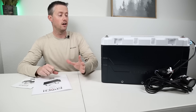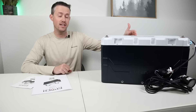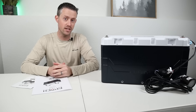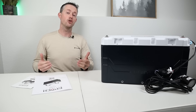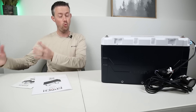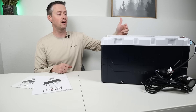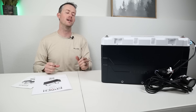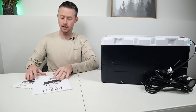Comparing the performance of version 2 versus version 1: we got 477 amp hours from this version and 470 amp hours from the previous — a slight improvement. Interestingly, this version is rated for 230 amps continuous output while Gen 1 was rated for 300 amps continuous. I'm curious to see inside whether they have a smaller BMS, the same 300-amp BMS, or if they're simply recommending lower amperage for better cell longevity.